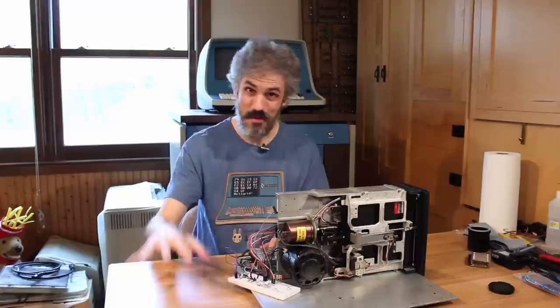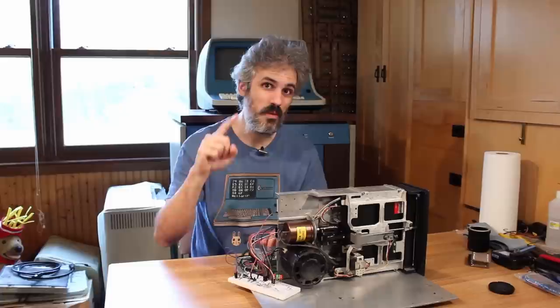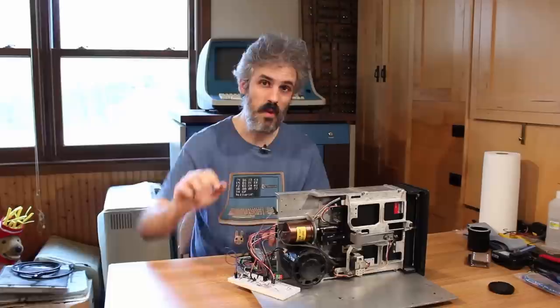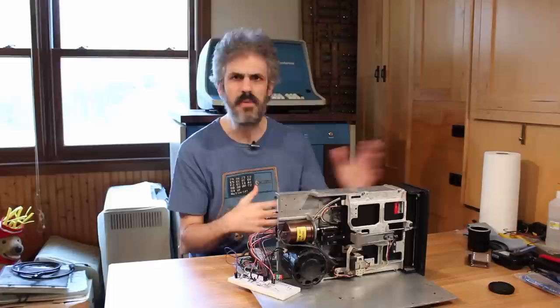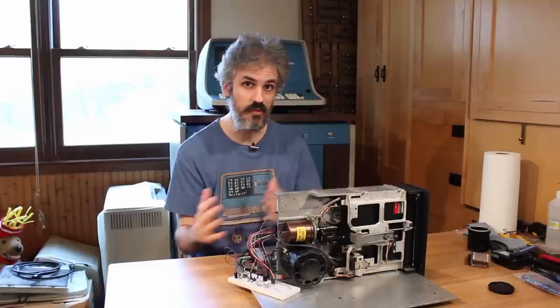Now you may notice that my HP 200CD signal generator here is missing, and that's because that was the problem. I was using that 200CD signal generator to generate a sine wave and I cranked the amplitude up on it. I was thinking that if the rise time and fall time of the sine wave was fast enough, when that sine wave went into a 2N2222 NPN transistor, it would transition it from saturation to cutoff and back quick enough that we wouldn't get any messy edges.